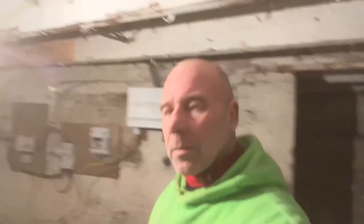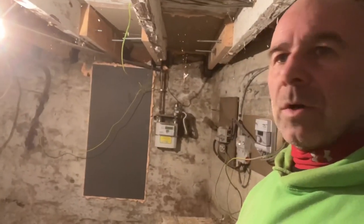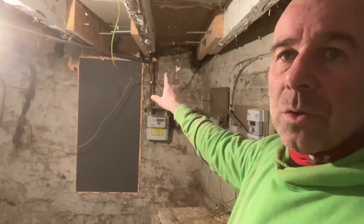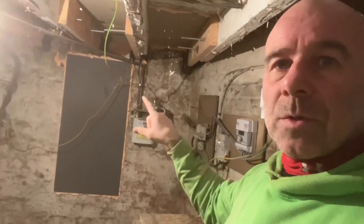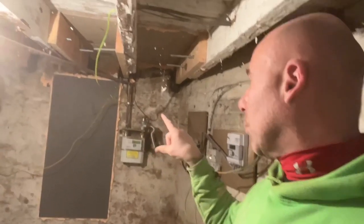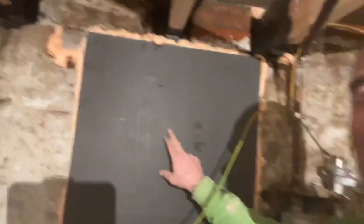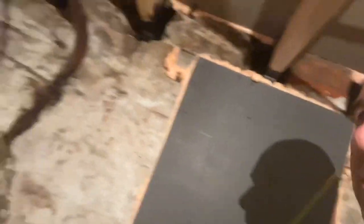Hi Dan, Sam here on this job in Lancaster Street. So we're halfway through the job, it's a Wednesday. This is what we've got so far. We've got two double air bricks that have been swapped to super flow plastic ones. This is where the fan's going to go — I'll bring the fan tomorrow, mark it out, and just cut out. That was stuck on yesterday.